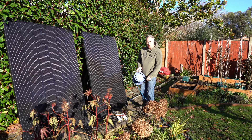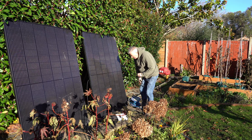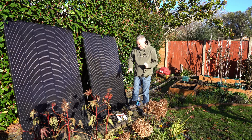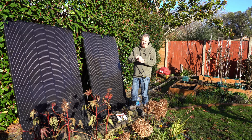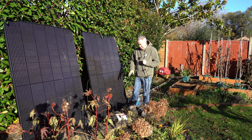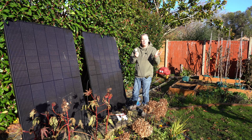Now another thing I maybe didn't explain very clearly — I'm going to unplug it. Now you may think the sun is still shining on these panels and the microinverter is still working away here, so there'll be power on this. Isn't that unsafe? No, it's not. The architecture of these microinverters — in fact all the inverters you have in a house — are designed to prevent ever putting power into a system if the power has gone off.